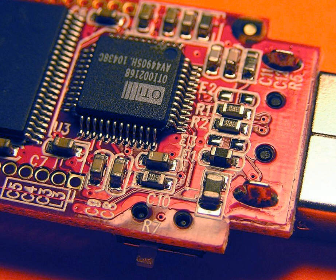Light gray body color indicates a capacitance which is generally less than 100 picofarads. Medium gray color indicates a capacitance anywhere from 10 picofarads to 10 nanofarads. Light brown color indicates a capacitance in a range from 1 nanofarad to 100 nanofarads. Medium brown color indicates a capacitance in a range from 10 nanofarads to 1 microfarad. Dark brown color indicates a capacitance from 100 nanofarads to 10 microfarads.